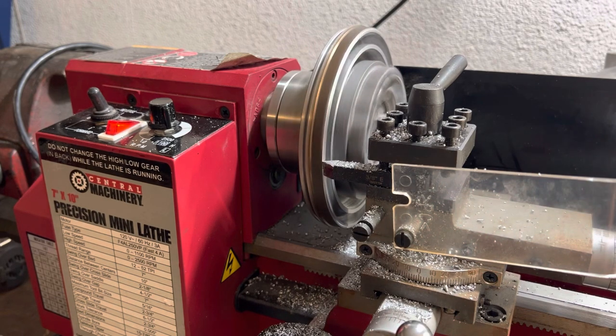I'm going to back it up a bit — I won't make you listen because it squeals and makes quite a bit of noise; it has a loud pitch while cutting because it echoes through the aluminum. What I'll do is take 25 thousandths at a time, knock off four or five passes. You can stop and measure it at any time on the lathe.